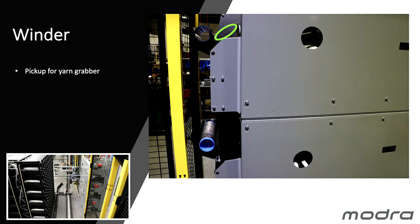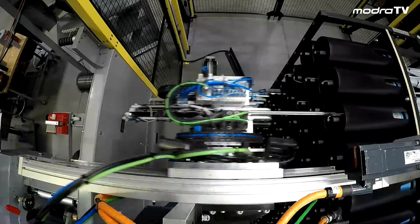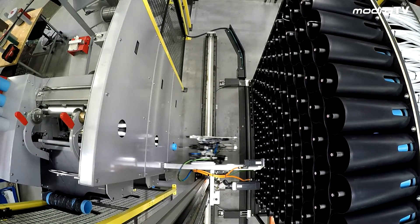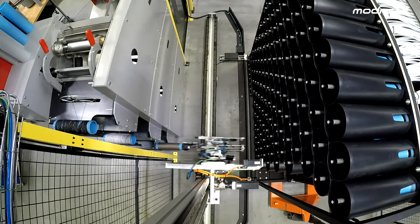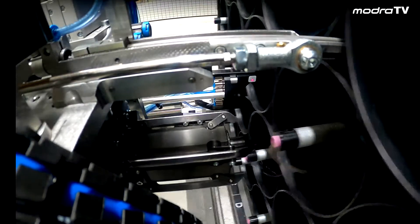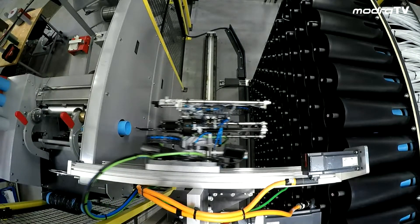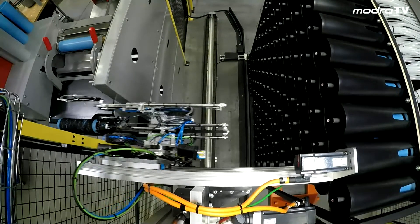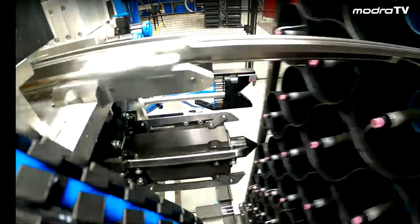Here's the view from the robot — the area where it picks up the yarn, and where the empty core goes. The robot attends to the top position next, which is ideal for describing the pickup of yarn at the top winder. The empty core is extracted and transferred to the top. As the empty goes in, the spindle starts winding. We grab the yarn, hold it, cut it, then grab the centre and transfer the whole package back to the position we removed the empty from, blowing through to the front header with a metered amount of yarn.